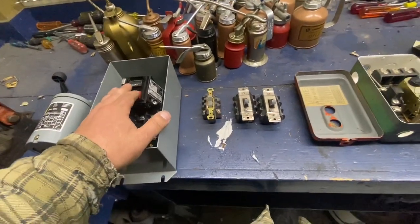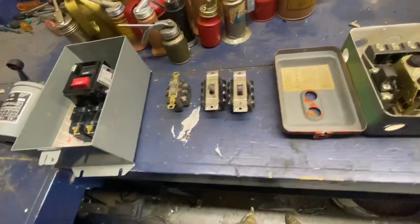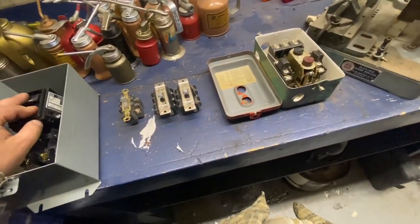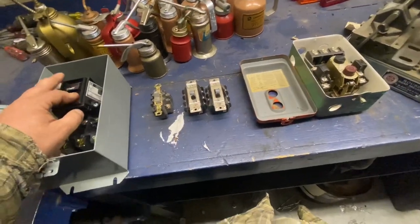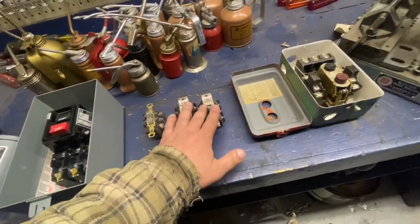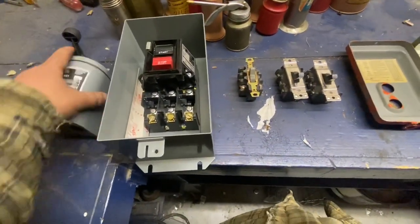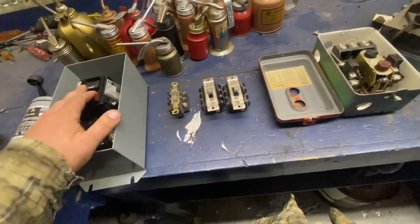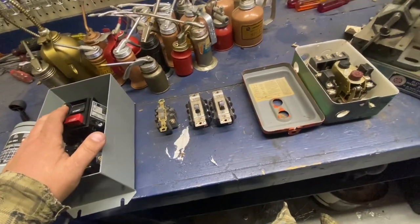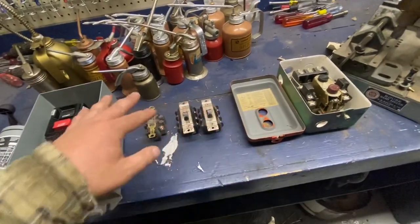Do not oversize your breakers — make your breakers right where they need to be to protect your equipment. Don't wire a one-horsepower motor with a 100-amp breaker before it; that will cause damage before the breaker trips. So in the smaller horsepower ranges you have lots of options. I wouldn't recommend using a plain light switch even though I've seen machines with those. Remember you're putting 220 through there, and if you're using the pony motor method, the lower inrush amps help save the switches too.